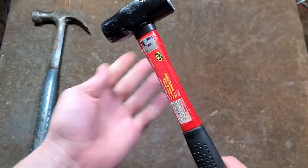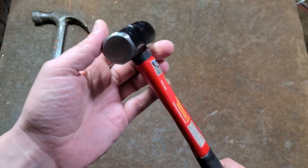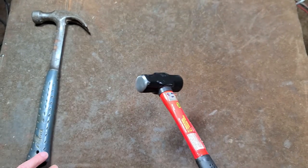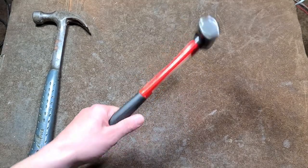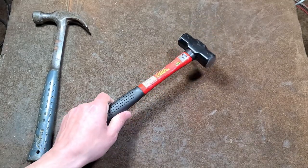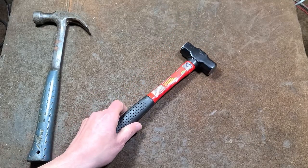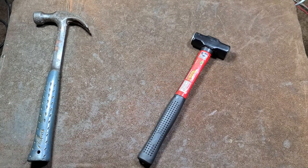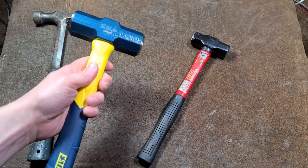These are useful in demolition or junkyard situations where you might miss-hit, damage the handle, lose it, or bang against hardened steel and beat up the head — and you're just not too worried about it. Generally, these one-pound hammers are handy because they give you a lot of swing force and inertia in a fairly compact package. They wouldn't be considered engineering or striking hammers, which are more in the two-and-a-half pound range.